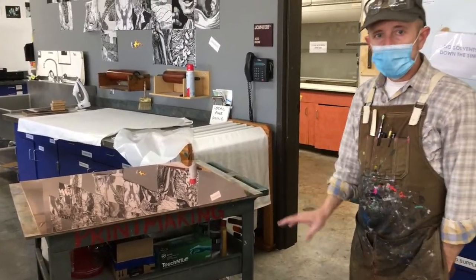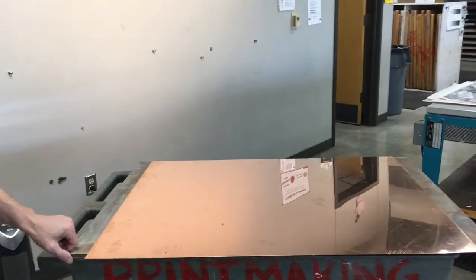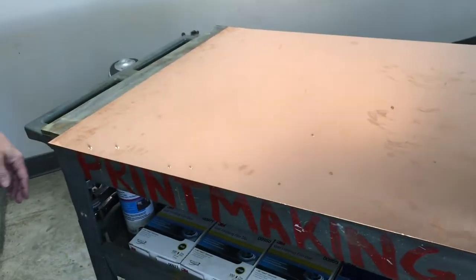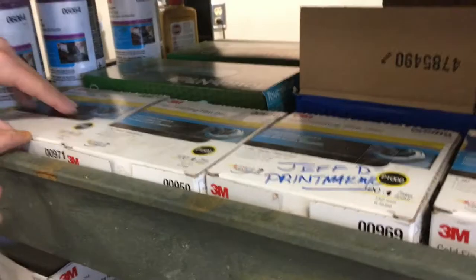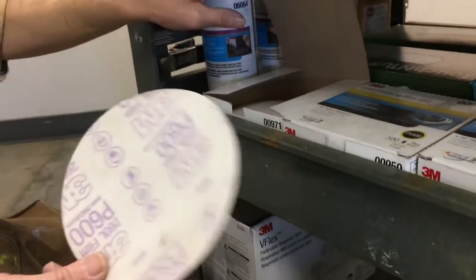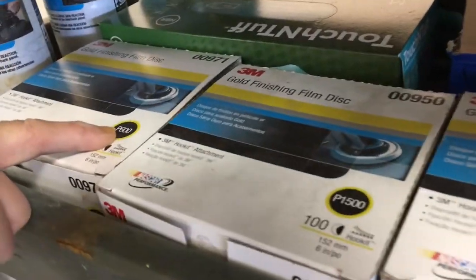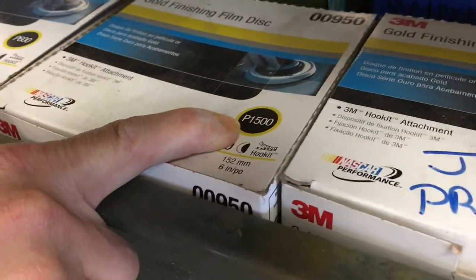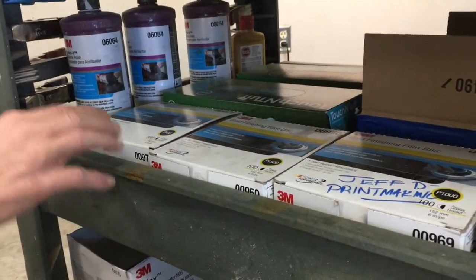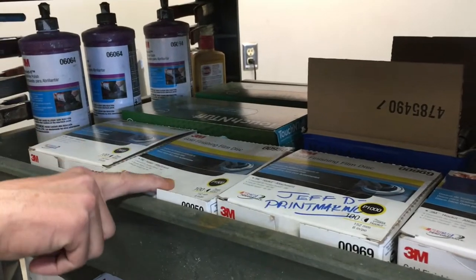The biggest danger is inhalation. So take a look around this cart. There's a big flat top with a piece of plywood permanently attached to it — that's our work table. These are the abrasive pads that we're going to use on the sander polisher to remove the grain. The pads come in three grits: 600, 1,000, and 1,500. The higher number is the finer grit. We are going to use these in sequence from 600, then to the 1,000, and then finish with the 1,500.